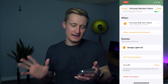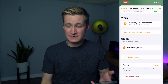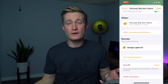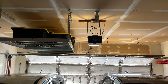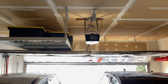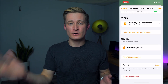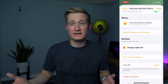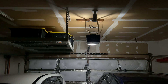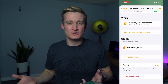You'll see that I've added a custom condition that only turns on these lights if the garage door is closed. That's because if the garage door is open, I probably don't need these lights on — either it's daytime with light shining into the garage, so I don't need the lights on, or I've just opened or closed the garage door and the light on the actual garage door opener is on for a little bit. So I don't need the main lights to additionally turn on.